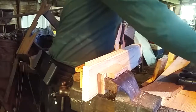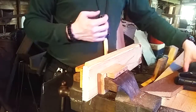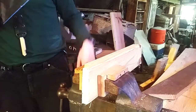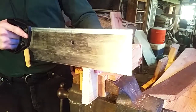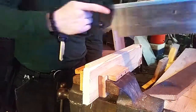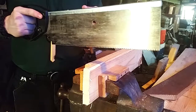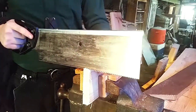Now, there shouldn't be that much force anyway, because you shouldn't be transferring too much force onto the wood itself, because that's a huge part of the digging problem, is when it moves the entire table that way. That is a symptom of the problem. It shouldn't be doing that. And if I'm pushing up here, that means that my line of action is off-center, and as I'm pushing forward, it's going to try to rotate the saw down and pull it into sticking, which is another part of the problem.